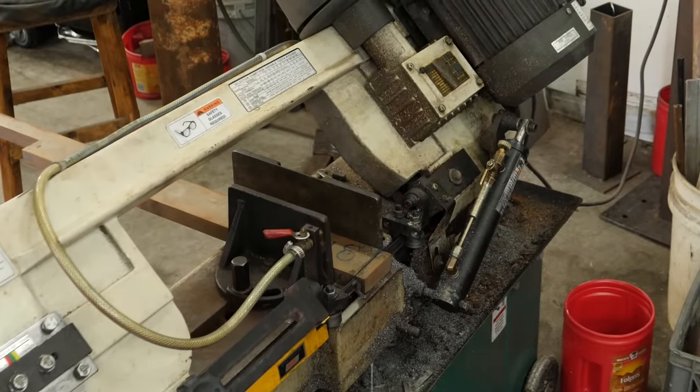I like to stop on the blade and focus on the rest of the handle when the blade is almost but not quite done, so I don't have to be extra careful to not scratch the blade while working on the guard and handle. I'm hand sanding the oxides off with some 3000-grit and then putting it back in for another soak in the ferric chloride. After etching the blade I neutralize it with water and baking soda before putting it in the coffee to make sure the ferric chloride doesn't eat away at it anymore. I'm using a high concentration of Nescafe instant bold coffee — this is going to help the oxides become even more dark and much more durable.